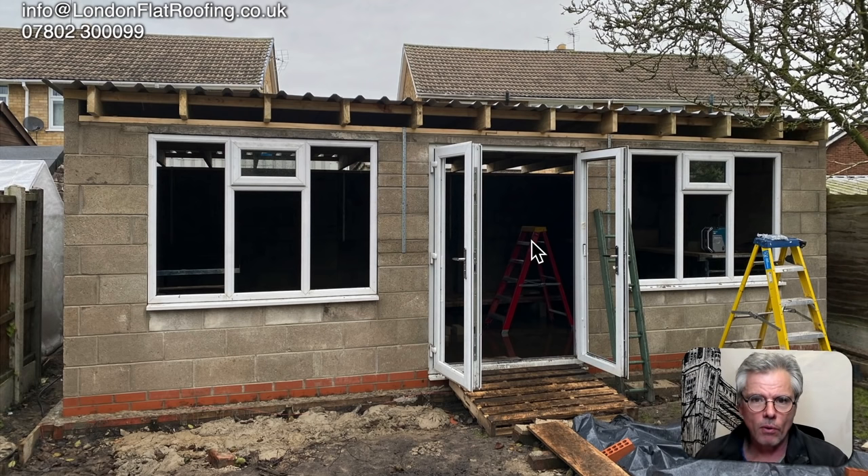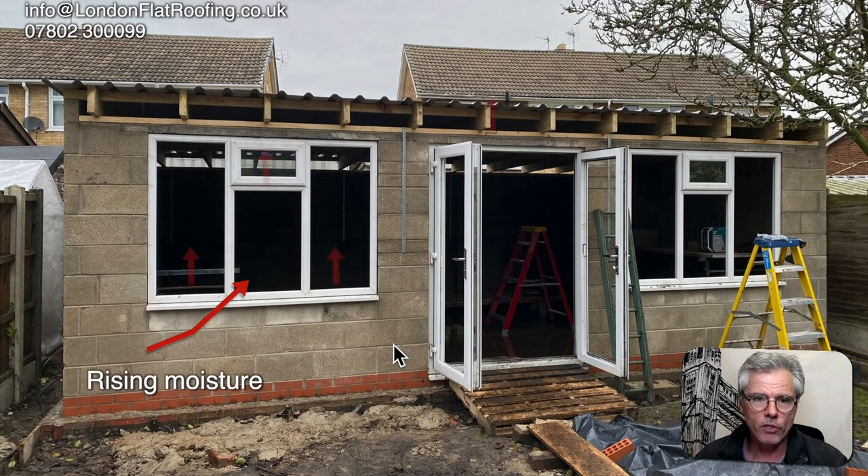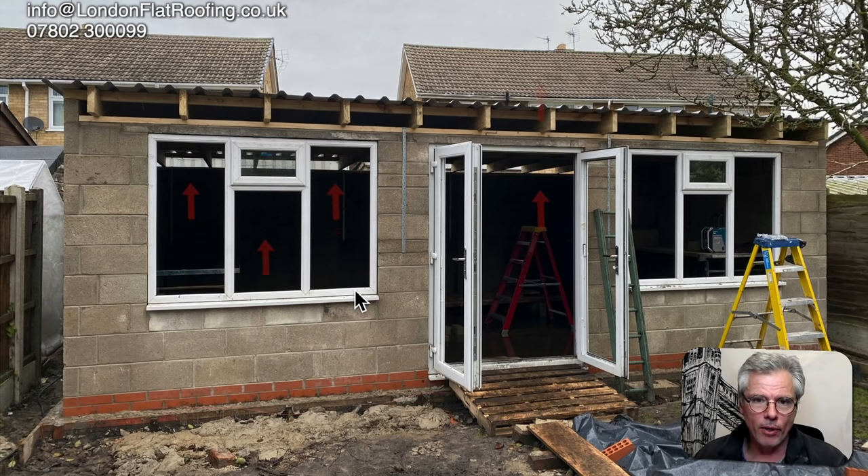No wonder he's got sweating going on inside, because he's on a building site — he's got what we call construction moisture on the inside. It's very important to understand that at this stage of the job you're always going to have construction moisture. All the timbers he's putting in are going to be high moisture content, and inside you've got screeding, brickwork, and all sorts going on. But just look at the external environment as well — he's got a massive amount of external moisture all the way around.